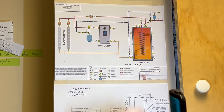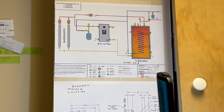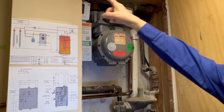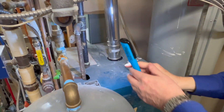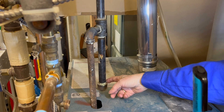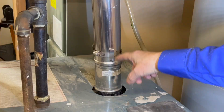Here's the boiler schematic. This shows baseboard heaters, but we don't have baseboard heaters — we have a forced air blower in the attic and a forced air blower right here behind the boiler. Here's the gas line coming into the house: it comes around, goes through the top, comes out, and goes behind into the boiler. This extra little pipe collects any moisture that's in the gas and lets it evaporate slowly so water doesn't go into the gas burner. Here is the flue — the carbon dioxide exhaust gas comes out this pipe and goes out the side of the house.